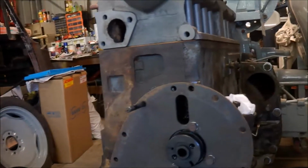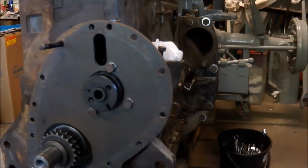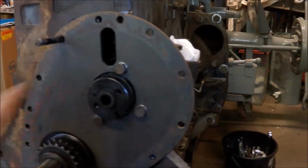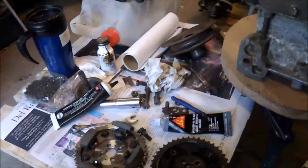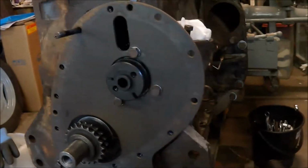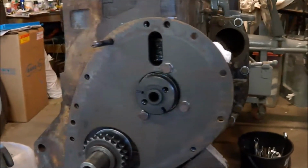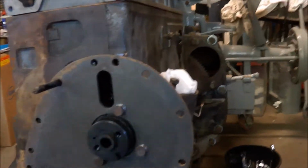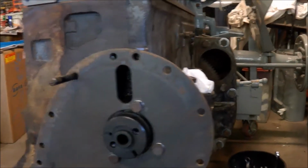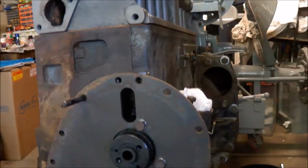Now, valve timing on the engine. You can look at the manual, and that gives you a pretty good idea of what you've got to do. But bearing in mind that I'm putting a new camshaft sprocket on, which is not marked, I've actually then got to find the proper position for top dead centre, and then the position of the camshaft. So I've got it properly lined up.